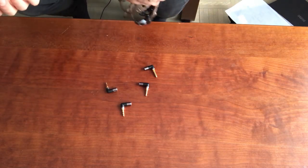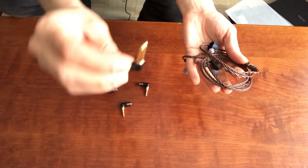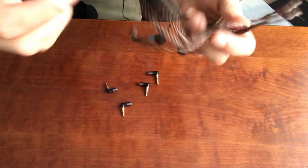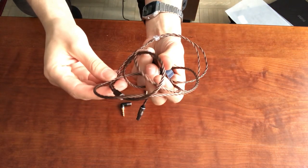Because of this adaptability with all the different connectors, it's a really good option for those who want an earphone they can grow with. Maybe down the road you'll want something with a 4.4mm output — with this earphone you don't have to switch out the entire cable, just swap the adapter quickly and easily. The cable has four conductors, which are a combination of copper and silver — OCC copper to be exact — and each strand also has an OCC copper shielding around it, which helps to eliminate electromagnetic interference.